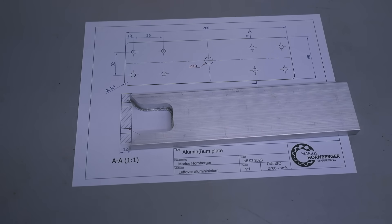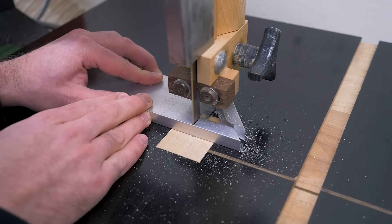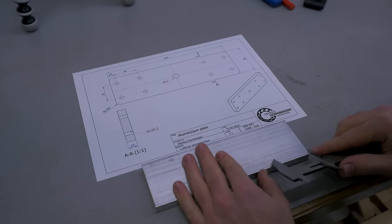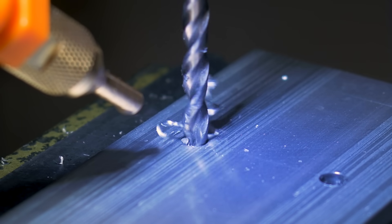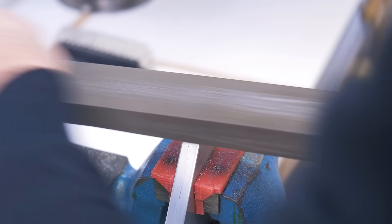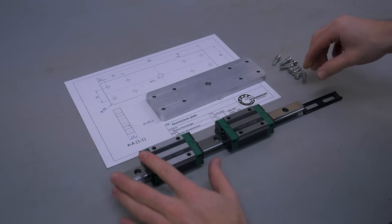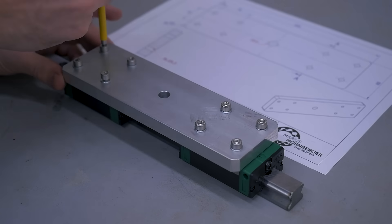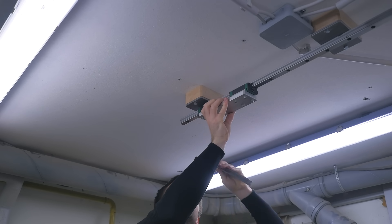Next is making an aluminum plate to mount the two blocks to. I had some leftover bar stock big enough for this purpose. I just cut off the other project leftovers and cleaned the edge on the table saw. Then marking the hole placement and drill pressing them. And after some more chamfered rounds and deburring, this part can be installed. I have another short but identical rail, so I don't have to do this over my head. From there I can slide it onto the long rail and test it out. Nice.